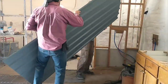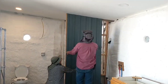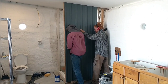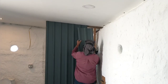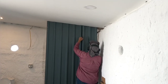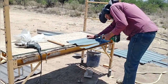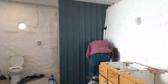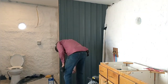This piece was a fairly straightforward cut — we just had to cut the top to match the slope of the roof. I wanted a nice tight fit so we didn't have to do anything with trim up at the top, and it looks like it's going to work great, so we're going to go ahead and screw it in. For the last piece I had to piece in two smaller sections, and I also cut a profile along it so it followed the contour of the earthbag wall as closely as possible. I was able to follow that contour pretty closely so no trim is required.